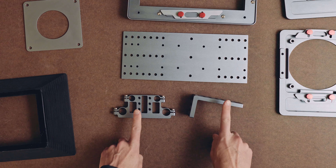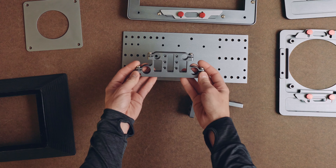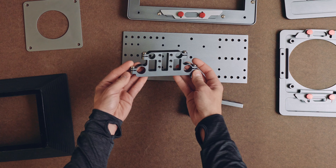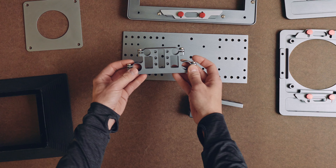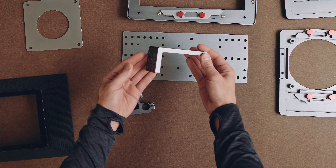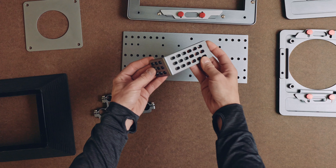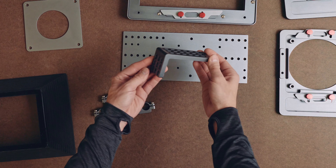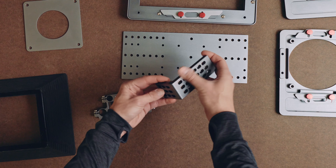The two new components are right here. This is the rail clamp and mounting plate. It's going to be used in every assembly of the F-Zero camera, not just those that need the Cine clamps, and I'll show you why in a minute. And then the camera mounting plate — this is a super robust 10-millimeter thick chunk of aluminum with holes everywhere, so that you can get your camera mounted right at the optical axis of the system quickly and easily.